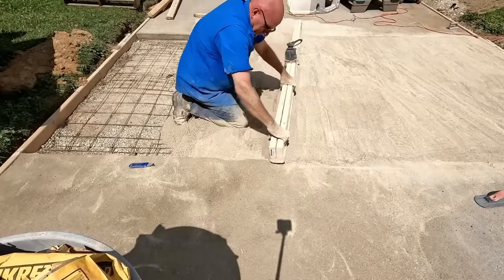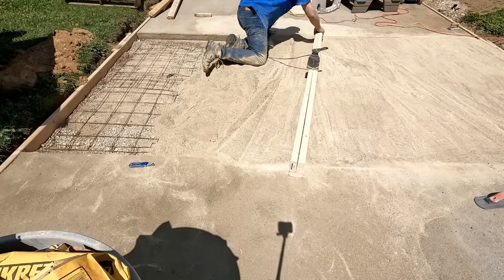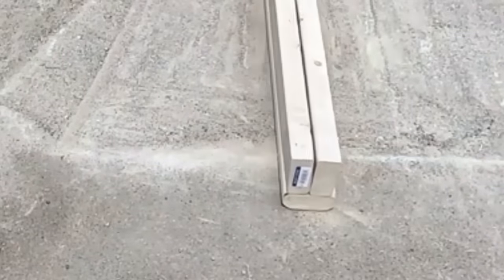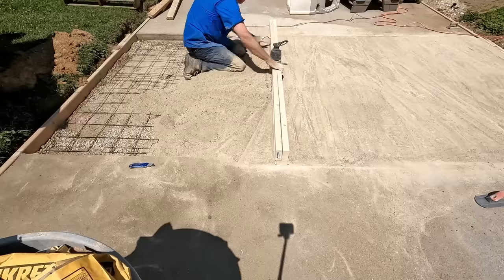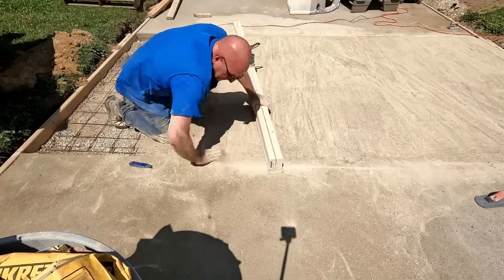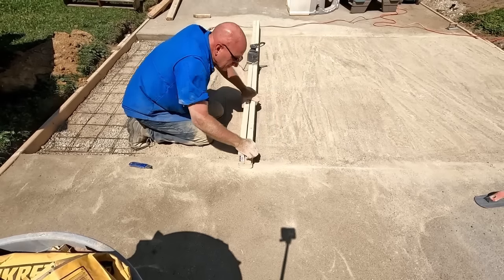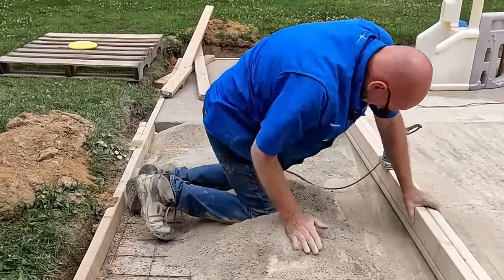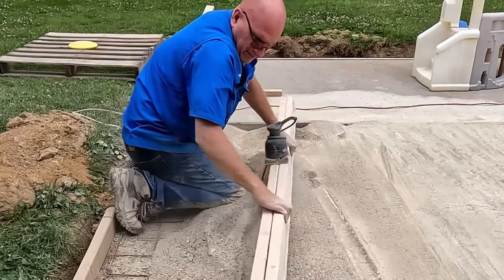So that's why I came up with this — basically it's a sander. The bottom board has some bevels on the leading edges so it works in either direction. That kind of packs the concrete mix down as you drag it. I see it's a little bit too packed there — I've got to dig it away a little bit because it packs so well that it kind of builds a wall. So I'll just work this down through the length of the slab.